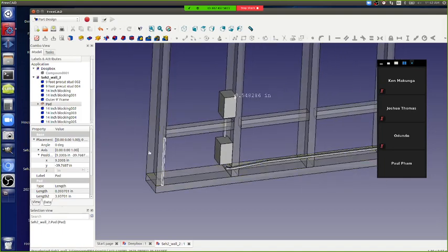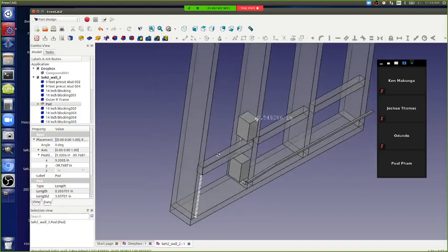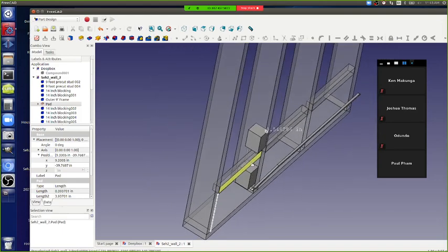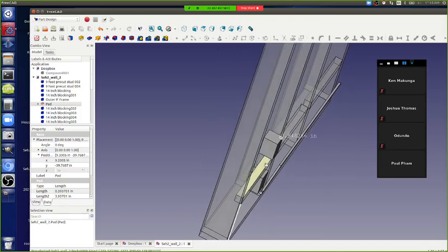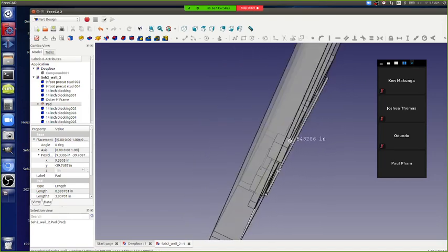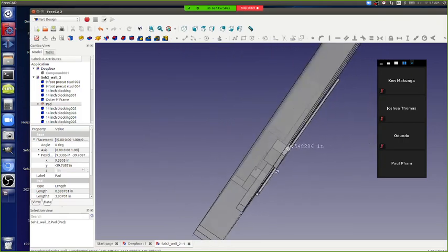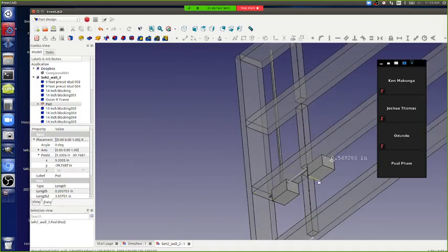First, because there are wires in there, you don't want to screw anything in here. You're screwing it at the top and bottom where there are no wires. And if you screw into this one here, which is 1.5 depth, you want to use shorter screws, like 1.5-inch screws. Otherwise, if the screws stick out, that's a danger point. You want to make sure the screws are not sticking out of the blocking that you're putting in, so you're not puncturing any of the wires.